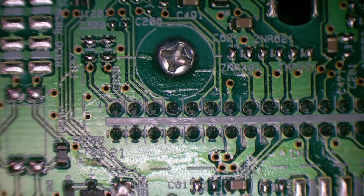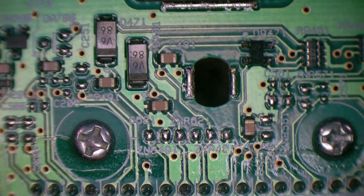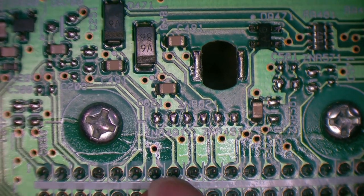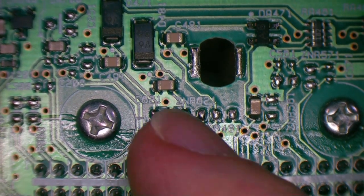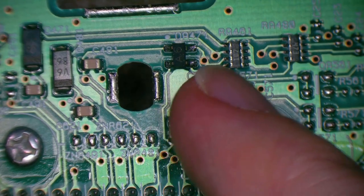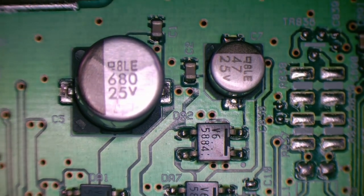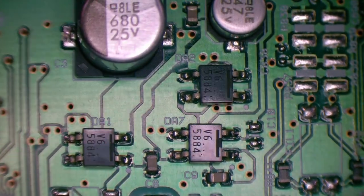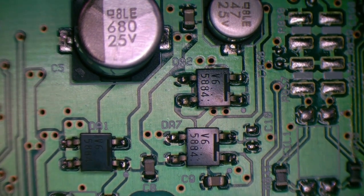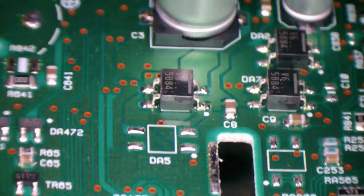We've got diodes on backwards, so that pin there goes up to a diode, but that's not passing through that way. And then we've got another pin that goes up to that diode, then they head off to these resistors and out somewhere. We've got our capacitors here. That's likely going to be on our 12 volt in, and what looks like a couple of, they're not bridge rectifiers, they'll be just twin diode packs surely, but they look alright.